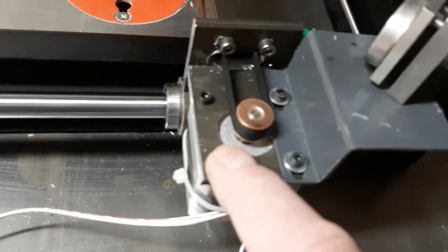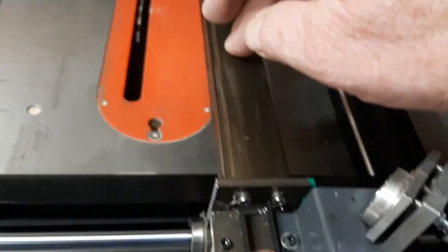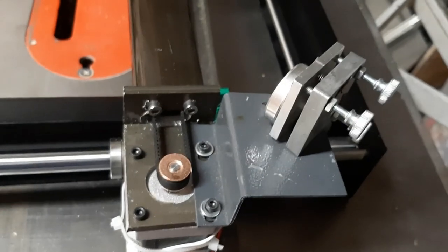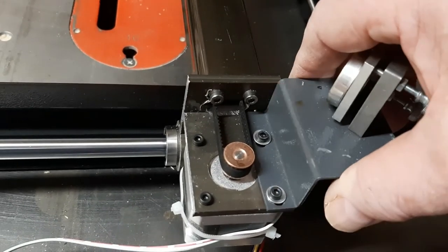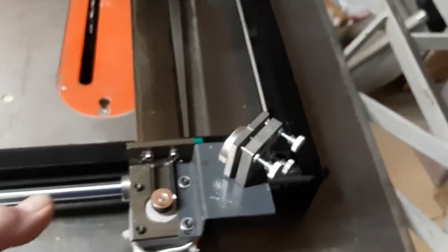This is where you're going to make your adjustment for the out-of-square X-rail. These screws here hold — and I don't have it tight because I haven't lined up my mirrors — these are the screws that you're going to loosen so that you can move this plate and do whatever you need to do in order to align your number two mirror.